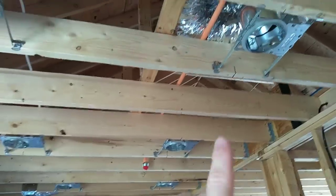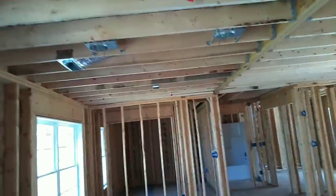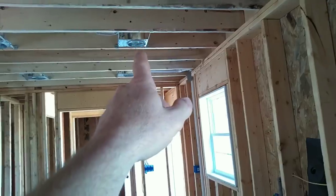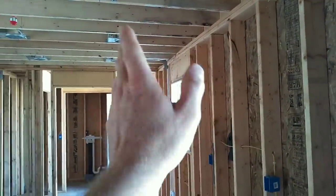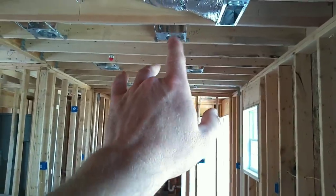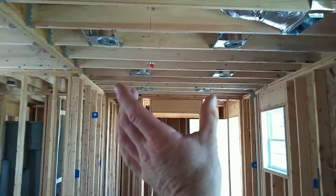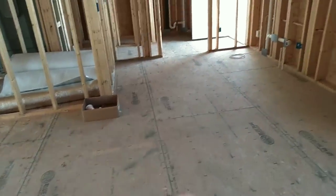There are six cans in this kitchen. These are not all lined up — two are in line and one is offset. The reason I offset the ceiling cans: these cans from wall to center are 32 and a half inches out; the refrigerator sits right here. I do not want the ceiling can to shine down on the refrigerator. If I put them all in line, all your light would be lost on top of the refrigerator. So I staggered those two cans so the center-to-center measurements are consistent. There's going to be a peninsula here too, so the lighting should serve this kitchen well.